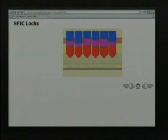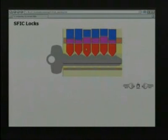These are all the pins. This dark brown is the control sleeve. A user's key goes in, and look at the user's key raises the key pins to the shear line, so the plug will spin. The control sleeve will not. If you put a control key in, however, it'll just raise these pins, so the plug and the sleeve, notice these are all across lines, will operate as one solid block, and you can slide the sleeve out of the way. That's how you can eject the core.